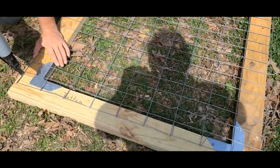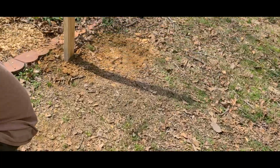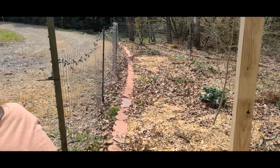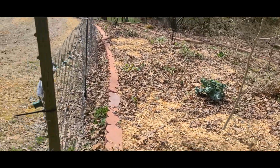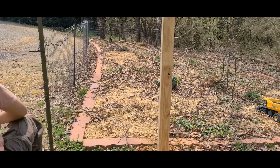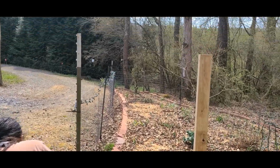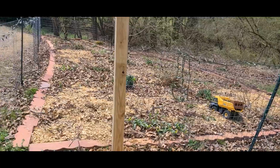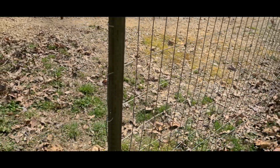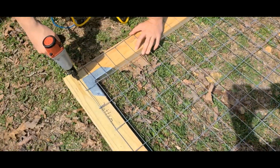We're back. So we're adding the piece of fence that we just cut off over here. Basically, we're just reusing it. We also leveled out this pole right here to be more straight with the 2x4 post. We just pulled it out and re-drove it in with the level. Now we have a more straight doorway there. Then we just tie wrap and staple the wire fencing into that post, and tie wrap it to this post. Now we're stapling it to the gate itself to add the barrier.